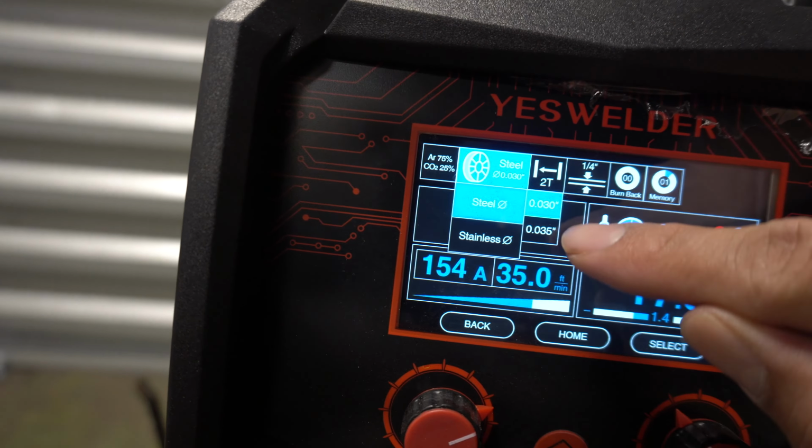One thing about light welding, MIG is really, really fast. I do a lot of work by myself. So for instance, if I'm welding in a hurry, gotta make sure everything's leveled. And let's just say I gotta make a tack. I don't even need a welding hood. I can just look away and it's tacked. And once I have a tack on there, I kinda just square it out, trying to make it leveled. And once I like that, then you put the next tack.